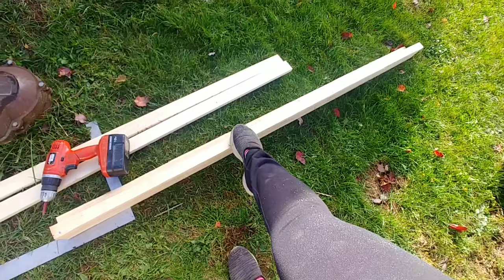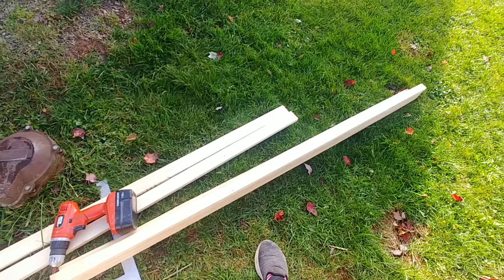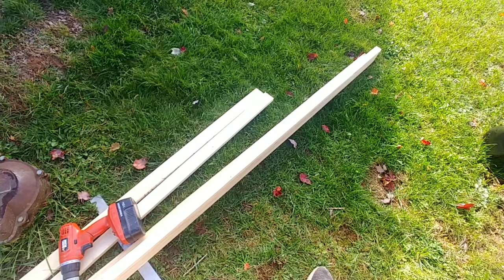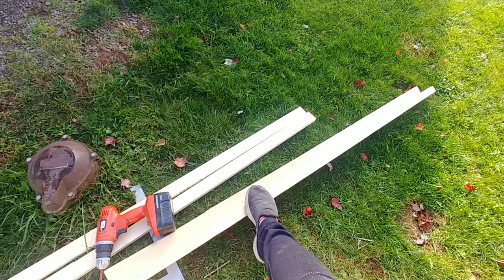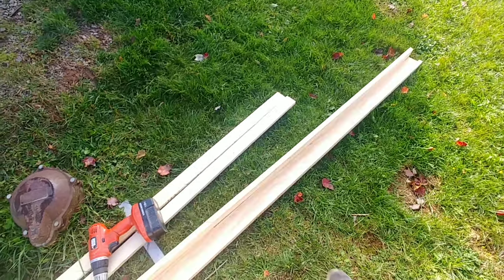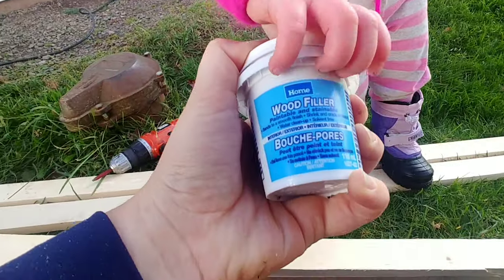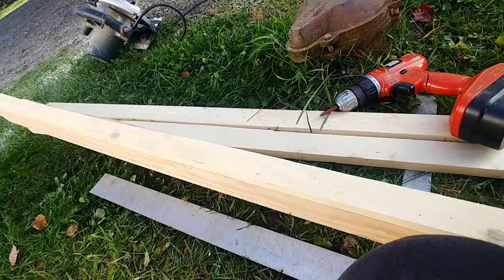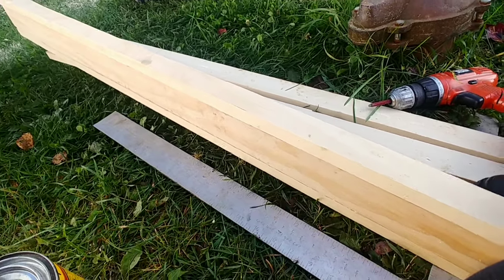Here it is — the picture ledge. I'm going to stain it. It's not perfect. This is not necessarily a how-to video, so maybe don't do what I did. Buy pre-cut lumber instead of trying to cut your own with a skill saw. Use an air nailer. I'm not a perfectionist — maybe that's a flaw but it is what it is. So this is what I filled the holes with: wood filler. It is paintable and stainable. I fill the holes, let it dry a bit, give it a little sand, then stain. I'm going to stain the rest of it and save the front for the end.